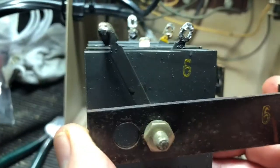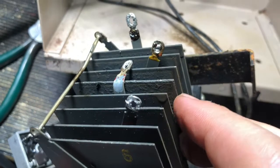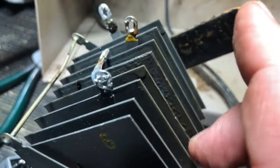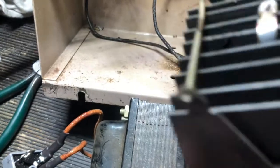So I pulled the rectifier off, and sure enough, when I could see it from a better perspective — you can see hopefully in this light — there's a bunch of spray on it. I think this is a selenium rectifier, and that's probably selenium there, maybe some paint over the top of it. It's all starting to bubble up. As these things get old, it does start to separate a little bit and the voltage starts decreasing. So this thing is basically dead.